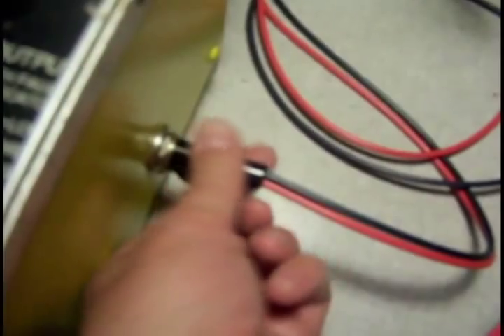It's basically designed to find cables underground and see if the cable has a fault in them. We can do that with a direct cable here that I have attached to the side of the unit, and I have it connected to a resistor box. The resistor box is representing a cable that has a shield problem — the insulation is broken and it's exposed to the earth.